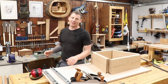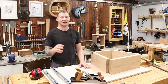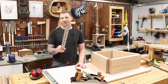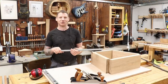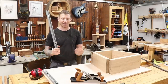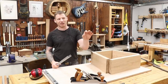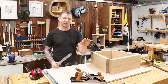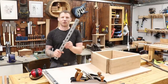Moving on to the legs, I'm going to do something a little unorthodox and mix in something I use every day in my job as an electrician — unistrut. You can basically build anything out of it; it comes in deep, shallow, slotted, and unslotted versions. Air conditioning guys and electricians use it for hanging cable tray, basket trunking, pipes, ductwork. Most guys would route C-channel into the end of their table, but my table is down below 40 millimeters — around 36 to 38 mil — so I don't want to remove any more timber.